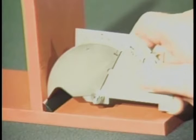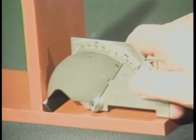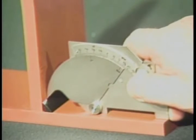To measure fillet weld leg length, place the tip at the toe of the weld. Again, lower the legs of the gauge to the surface of the plate and read the actual leg length from this scale. This measurement should read 3/8 of an inch for this weld.